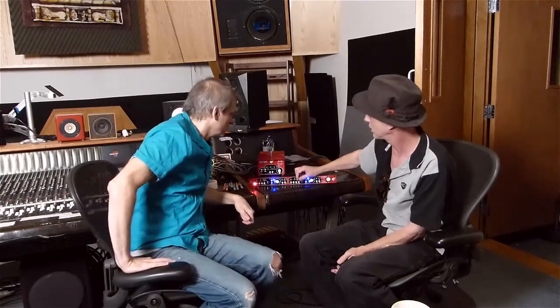I actually used the impedance switch with an older Shure mic — a high impedance mic on a cable about 80 feet long, plugged into a piano. On the high impedance setting it sounded great and made a noticeable difference. With some other mics you won't hear any difference, so you'd just leave it on low.